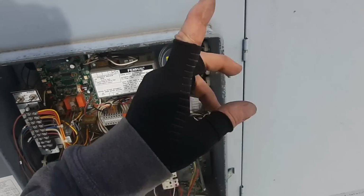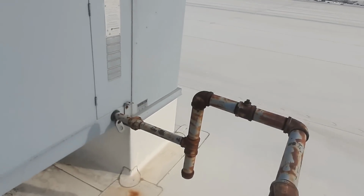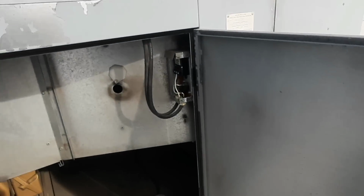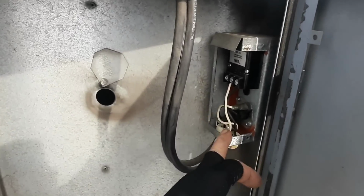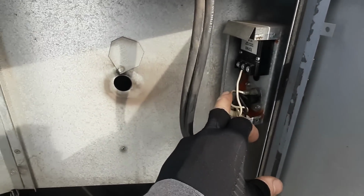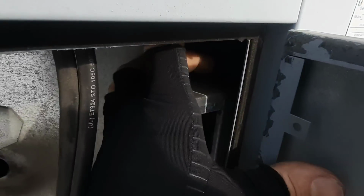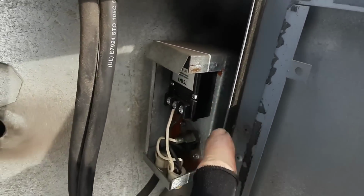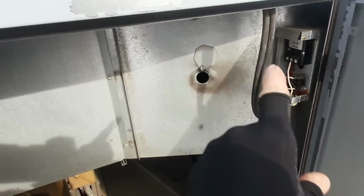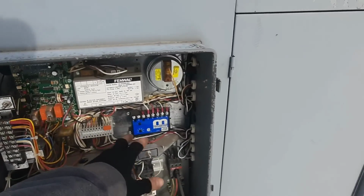So what I'm gonna do is we're gonna get a temp probe in there. Usually what I do, some of the older ones actually had temp probes already there, and you would just plug the K-type into your meter. I'm gonna get somewhere in here and see, there's a little hole up top I might be able to slide my probe down in, but I'm gonna get a probe over there and we'll fire it and make sure we're maintaining the 160.